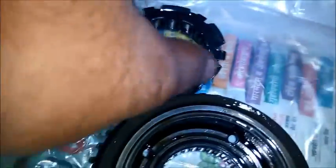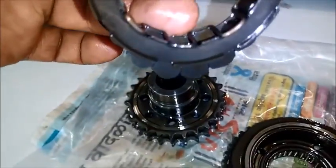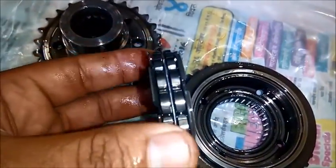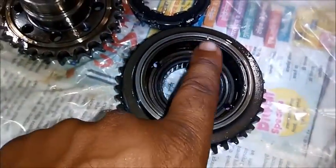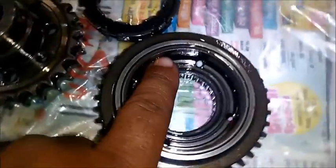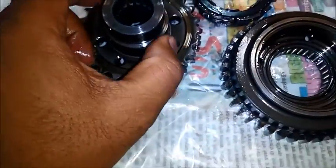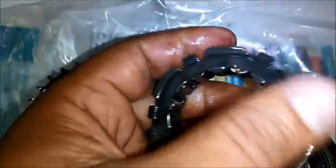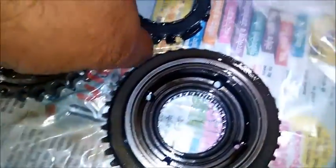The bearing is a unit with a different design. As you can see, the bearing balls are coming out of the unit, which tells us that the spring inside the bearing is gone due to over-slackness. Additionally, the ID of the housing and the OD of the socket must be maintained within specification. If the ID increases or the OD decreases, the bearing expands slightly. This main clutching surface grips between the two races, so it is a critical component.